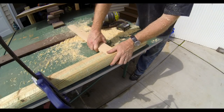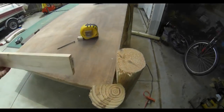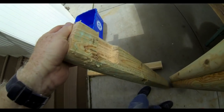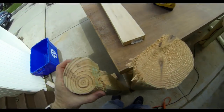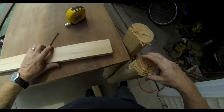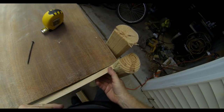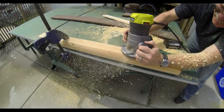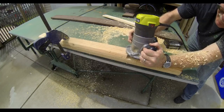You can change the height of this nautical top — you can change the height of the pilings, have them all the same height, or have alternating heights like I've done. This is the cutout that I did. All I did was measure basically where the top is going to be. I cut it a little bit wide so I had a little bit of wiggle room, but I wanted that one-by-three on the sides to be flush with the top of the tabletop.